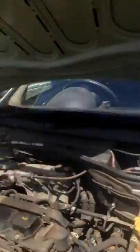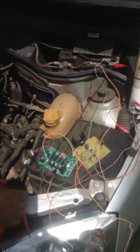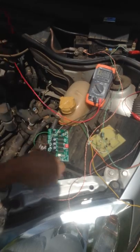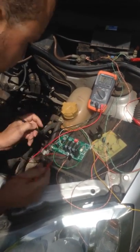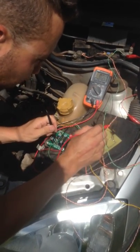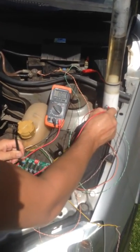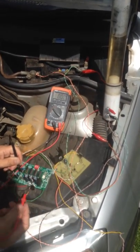Just have a look here with me. You can see we've got our voltmeter here. Now we've hooked it up exactly the way you said. We've got a ground here and we go to the middle pin of the MOSFET — we get 12 volts. That's fine. We keep it on ground, we go to the anode — we have 12 volts. We go to the cathode — we have 12 volts. I don't understand this.